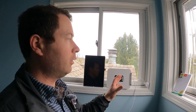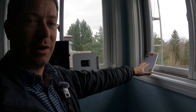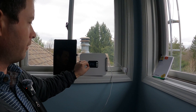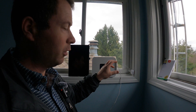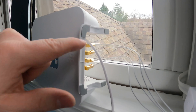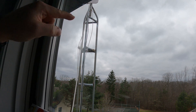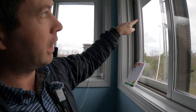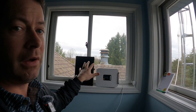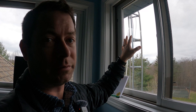This is the third-floor attic and we have the windows. The tower is actually behind the camera, so it's not out the windows — it's the other way around. This is where I have the G4AR setup. I just did a speed test, write down all my metrics from the app as well as speedtest.net, and do a couple tests. Then I screwed the antenna into the back of it — connectors in order: one, two, three, four. And up there, barely visible, is the Quad Mini up on the outside tower. It goes through the window here with a 10-foot cable that runs right up to that tower.